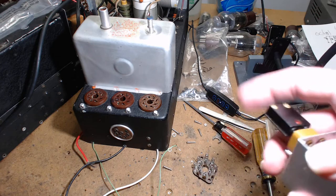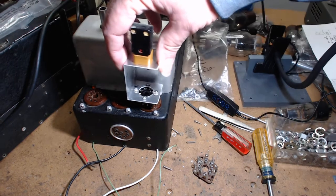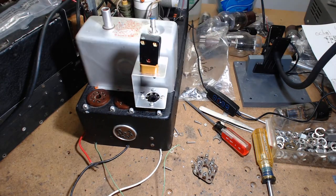I've been drilling Bakelite since I was in the 4th grade, because everything was, we really didn't have plastic around radios. Everything was like Bakelite cabinets. And if you take your time and drill it with a tiny drill first and then a series of other drills, you'll get a perfect hole in there. You won't get any spider cracks. But you have to have the patience, okay?